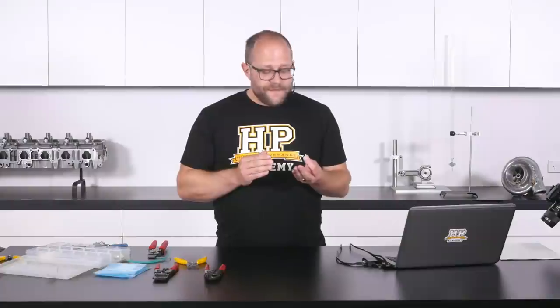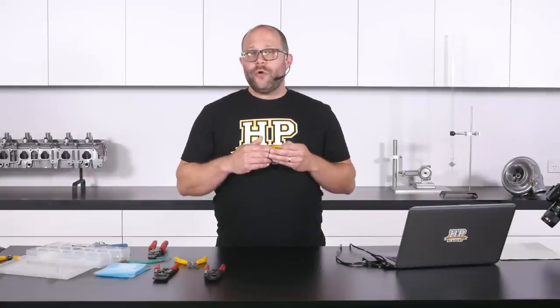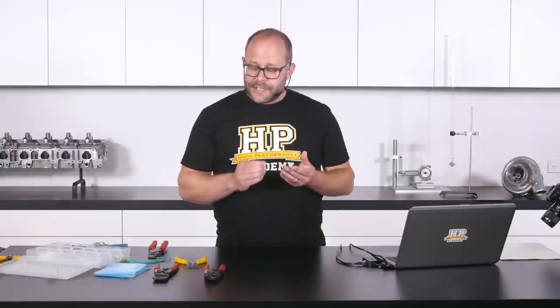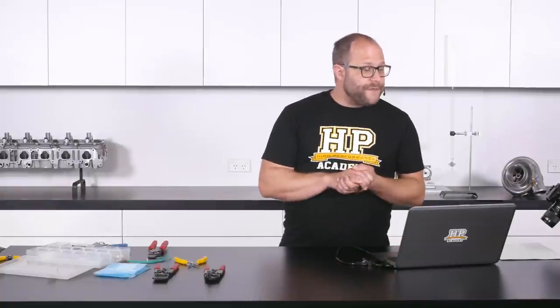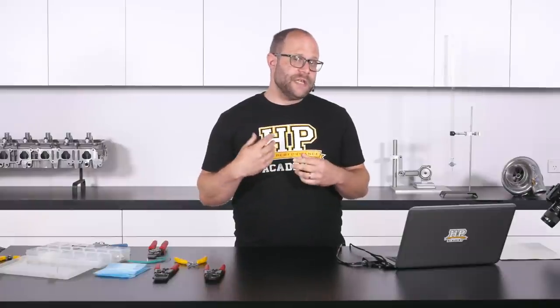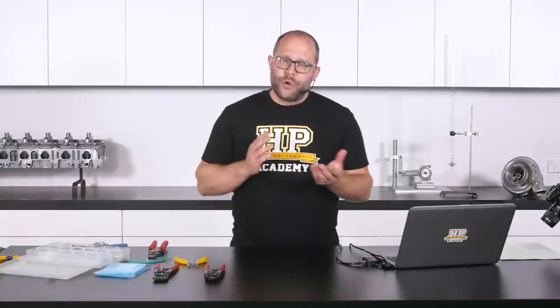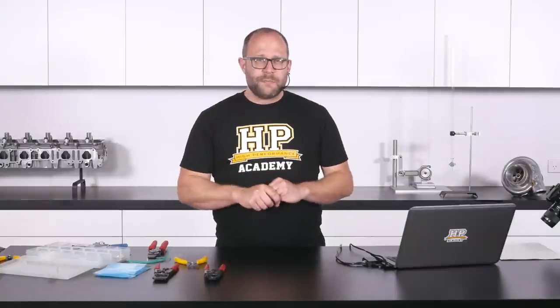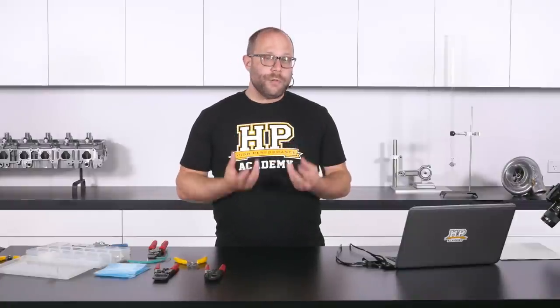For using these splices, it's very much an almost rinse and repeat of the process we've just gone through with our open barrel splice. We calculate the size of splice we're going to need — red spans CMA from 304 to 1510, blue is from 1058 to 2680, and yellow is from 2375 to 6755. You're not going to remember all that information now but it is in the document linked in the forum post. You go through exactly the same process of determining the CMA of the wire you're using — which in this instance is more than likely Tefzel wire with slightly different CMA values — and that gives you the right size splice to use.